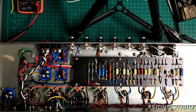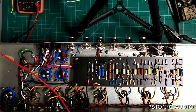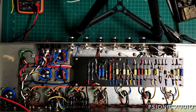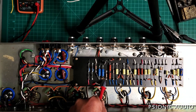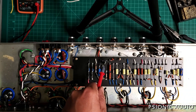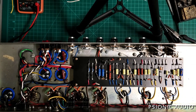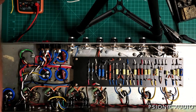I'm going to check the bias next, then I'll check the heater connections. At the bias right now, with no current limiter and 120V mains from the wall, the raw bias is negative 52V, negative 51.8V. That's with the trim pot all the way at minimum. Let me find my little screwdriver — here it is.